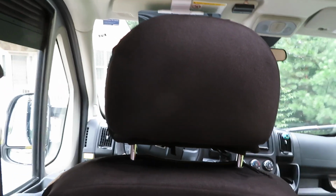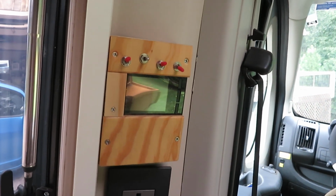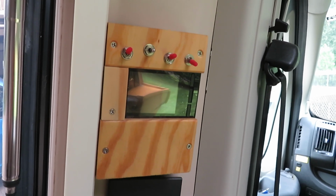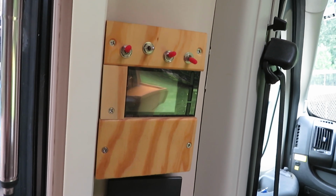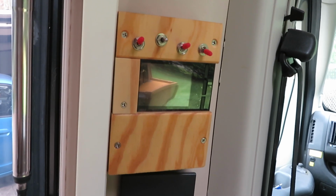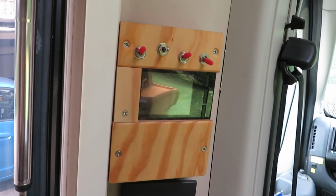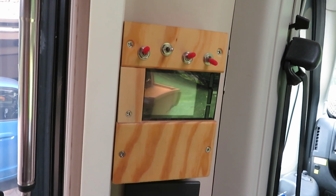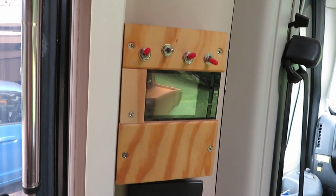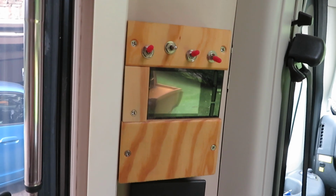And I use a few pieces of instrument to help re-engineering a lot of the electrical work done in Mayflower. This is a cell monitor. It hooks up directly to the battery box, bypassing the BMS. And also I install a 5 amp cell balancer that actually balances the cell to a millivolt level. The average imbalance on EcoTrack right now is about 72 millivolts. So this cell balancer makes it very nice to go down to the millivolt level.